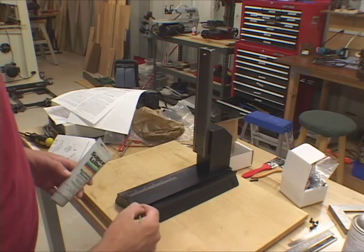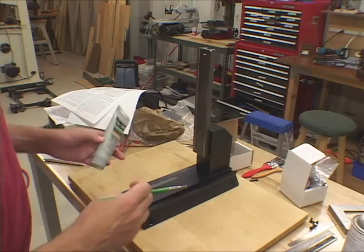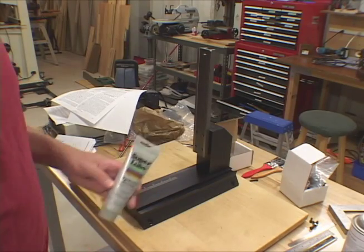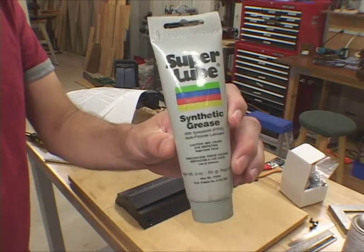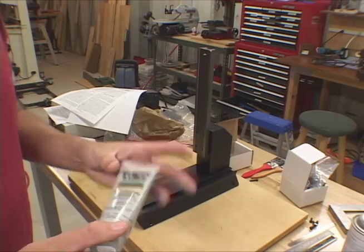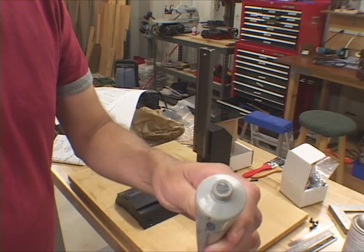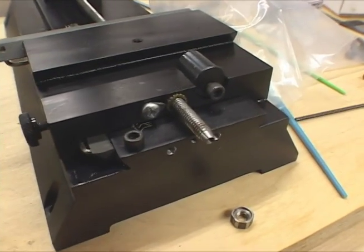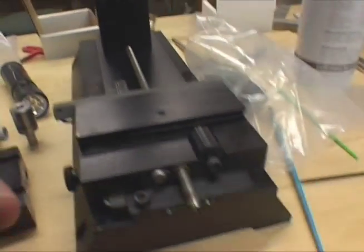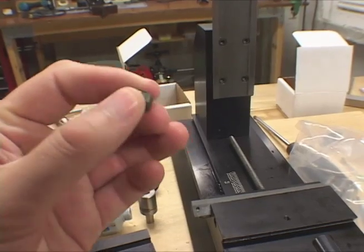Now I think I need to grease the slides here. They originally had some grease but it was kind of dried up, and after I cleaned it there's nothing on it. So I'm going to use this Super Lube synthetic grease — it has a nice clear consistency. Now we're ready to put the preload nut on — it's this little guy right here. Notice there's like a cup: one side is sort of flush and the other side has a little cup.